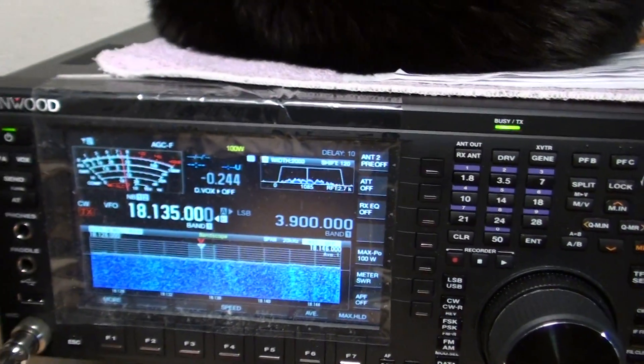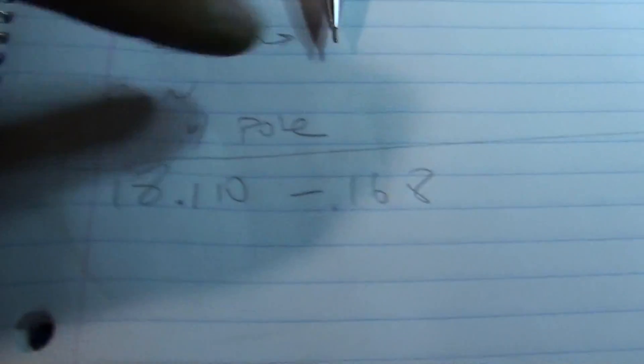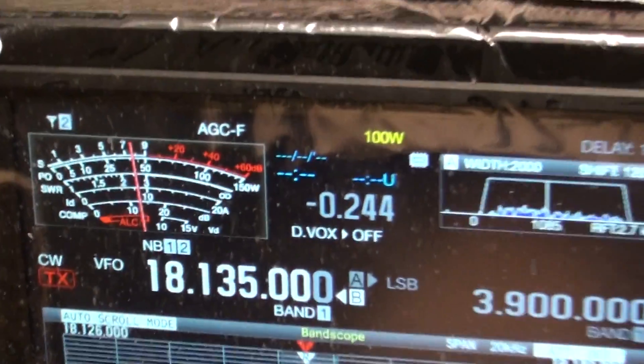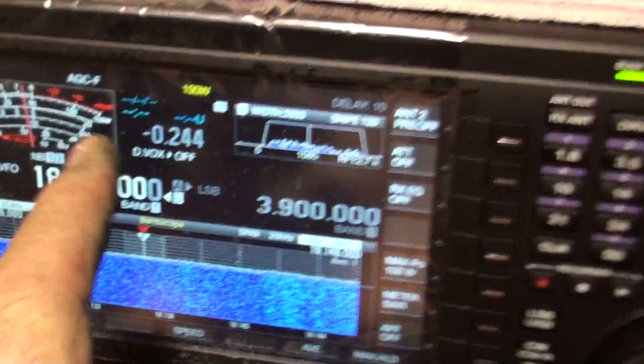There's Phoebe sleeping on the radio. I tuned this up on 17 meters — I'm brand new to 17 meters. I hit the 18 MHz button and looked it up on the web: it's 18.110 to 18.168 MHz. So somewhere around 18.130 is mid-band, and that's where the RigExpert was showing the SWR landing.